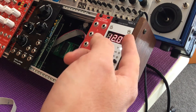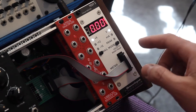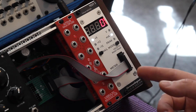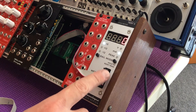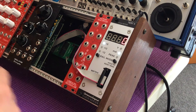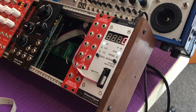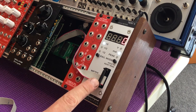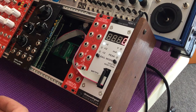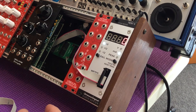We're not going to test the 5 volt rail because I just don't have it. You can check the voltage of your power supply by just flipping through these. When you put it in mA mode, which is current consumption, you can still cycle through the rails and see the current consumption on each rail of the module connected to this output. You can use a strip cable and connect many modules, or test a whole array. But I think it's a good idea to test them one at a time and take notes. Modular Grid will say what the expected current consumption is on most modules, but nothing will beat actually testing them yourself.